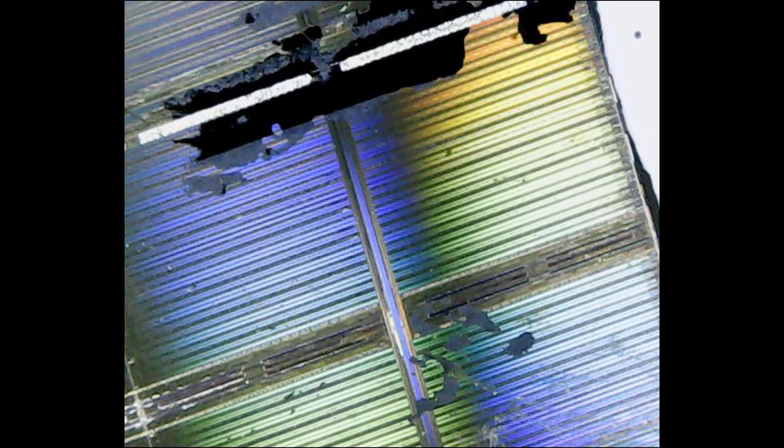One final thing: measuring the actual chip. It's not square — it's slightly rectangular. The dimensions are 9 millimeters by 8 millimeters by 0.2 millimeters thick. It's quite a thin piece of silicon — it just doesn't require that many layers and gets done in a very small footprint. Obviously it works.